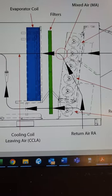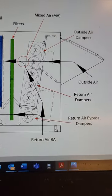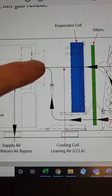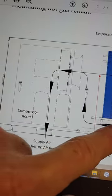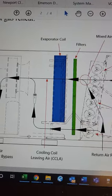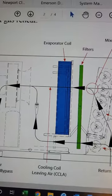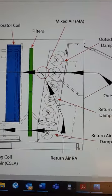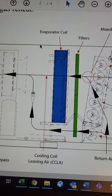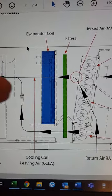Something else to mention here: because of this design, to avoid over-cooling the space, you're mixing both volumes of air right about here, and the volume of the bypass air is about 20% of the total volume. If you ran this coil at, say, 55 degrees — which would be a traditional discharge air temperature on any other machine — you're mixing it with the bypass air, and you might end up with 65 degrees. So you would not over-cool the space with that temperature, and you'd still be dehumidifying it.